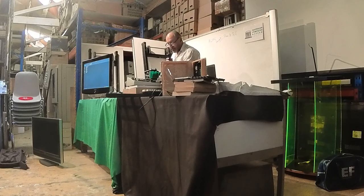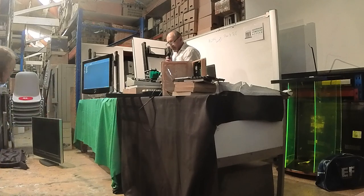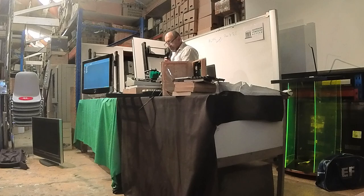All right. What other options have we got here? We can export hex dump. It's a particular standard hex dump. I'll just change the address to something with a bit of code. Let's do 100 bytes. And you can also hex dump the code, so you can actually see the actual opcode or the byte values.